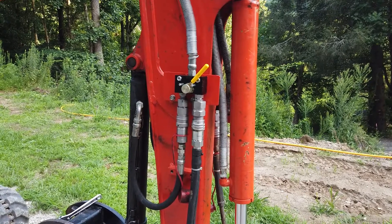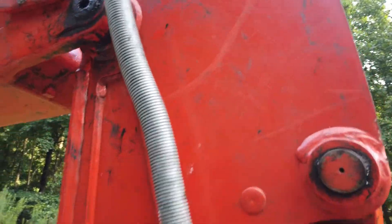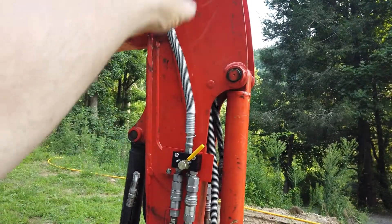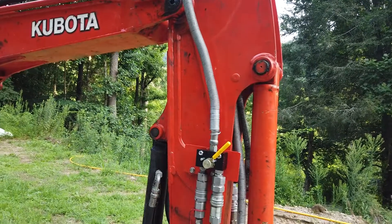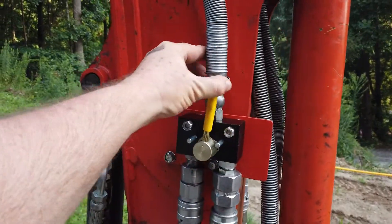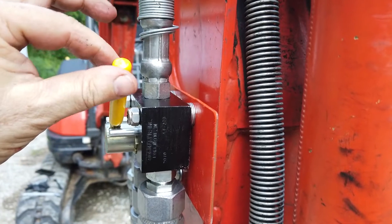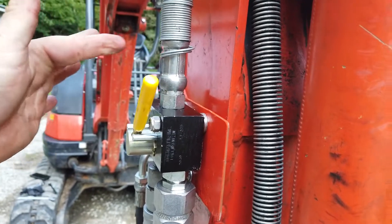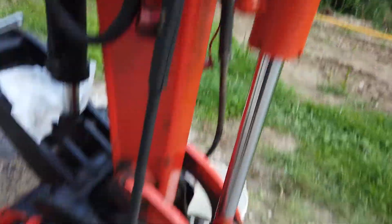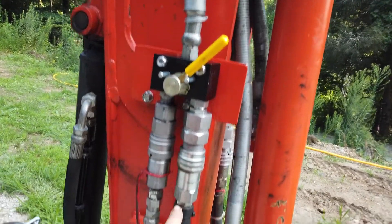She's on. I'll do a couple of tests here in a minute. It's possible I may have should put it even a little bit higher - we'll see how this does when I do the full bend, but this is about the mid-stretch point with the arm. When the arm goes out you'll see a bow in the top of this hydraulic hose, and when it curls it's got a shorter reach back to itself, so I'll test that to make sure nothing is straining. In this position it's running this hose for my thumb. If I want to run something else - right now I have a tilt bucket on - I'll just move it to the front and it'll flow through here and down this side for the mower.